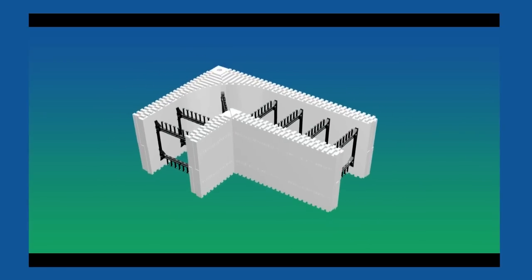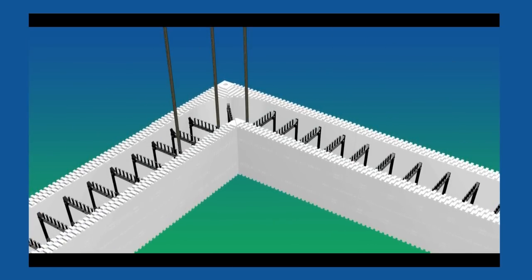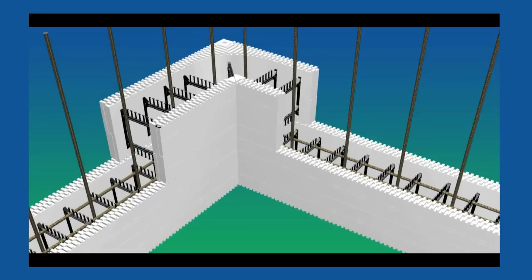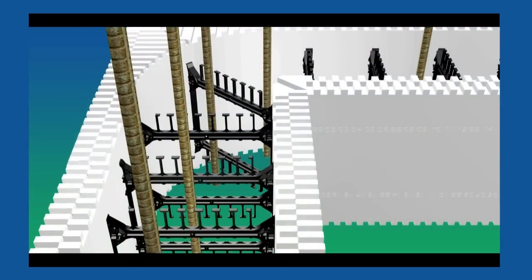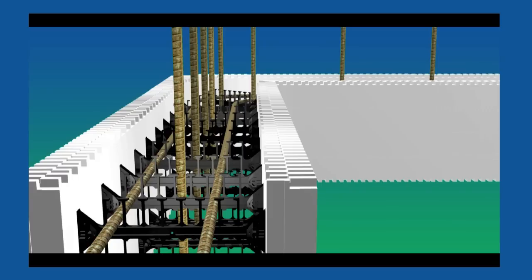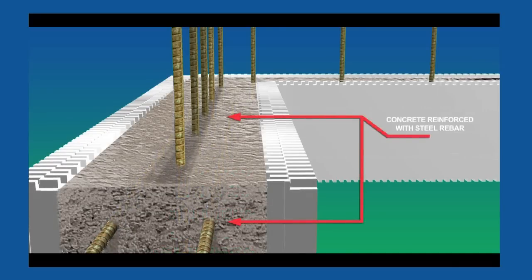Quality features such as a reversible design, high-density polypropylene web ties on 6-inch spacing for added strength, molded-in rebar holders, strong interlocking connections, multiple reinforcement placement options, and R21 insulating panels — when combined with the benefits of a monolithic poured-in-place concrete wall — provide one of the strongest, safest, most comfortable wall systems available on the market today at a cost that is unmatched for this level of quality.